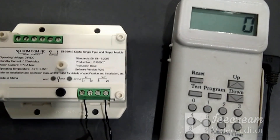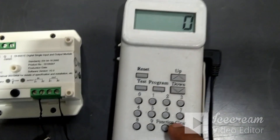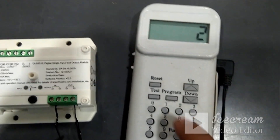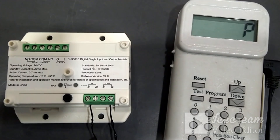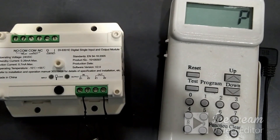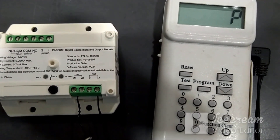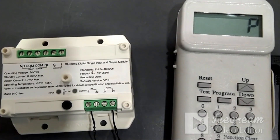The second mode is input and output mode. To change the programming, press 4, 5, 6, Clear, then Function 4 — you will get a dashed line. Now press 2 and press Program. The module will change into input and output mode. The first address programmed to this module will be taken as the input module address, and the very next address will be taken as the output module address. For example, if you program address number 5, then address 5 is the input module address and address 6 will be the output module address.